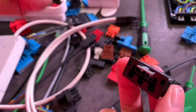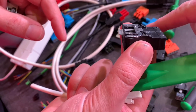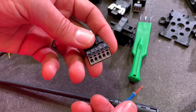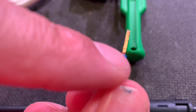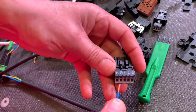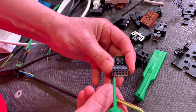A clever innovation on the chassis-mount version brings the earth connection out to the body — useful if you have a metallic fitting chassis that needs a CPC connection. It clips onto the chassis and already picks up the CPC. At the back are cage clamps with lots of conductor options: ferrules on flexible stranded cable, stranded cable directly into the clamp, or Wago's ultrasonically welded end on their pre-manufactured cables, which essentially creates a solid conductor you can push straight in.